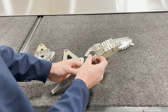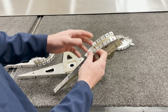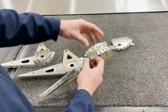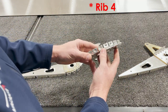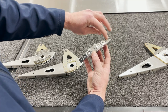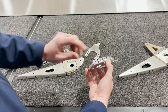Here's a close-up of the dimple detail — it's the top four holes, consistent across basically all of the ribs. So it's these top four here, not the front one, and then these four. With rib three, it's these four as well. Rib five is the only exception — it's all five of these holes along here. The very front hole is your overlapping skins and leading edge, so those don't get dimpled, but these five do, and also not the back one.